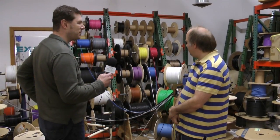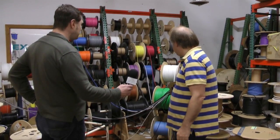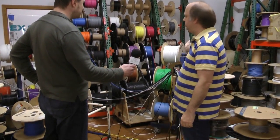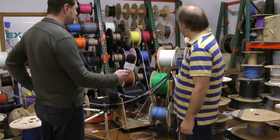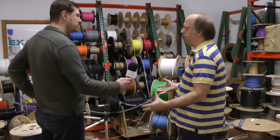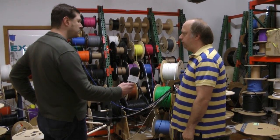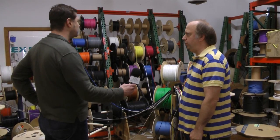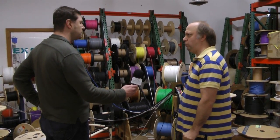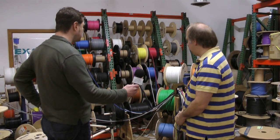As you can see, there are a lot of colors. We have a product like Belden 1694A — this is just a coax built for serial digital video use. It also happens to be really good for things like satellite antennas and high bandwidth coaxial applications. People like to have it in a lot of colors for patch panels or for keeping track of which wire is which in a large installation. So we carry that in 10 different colors.